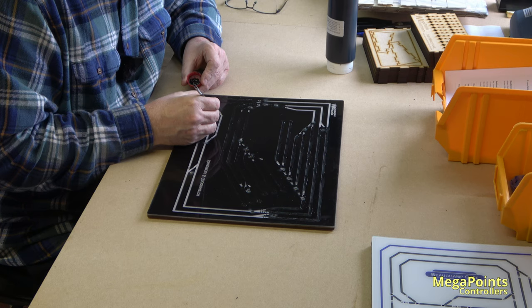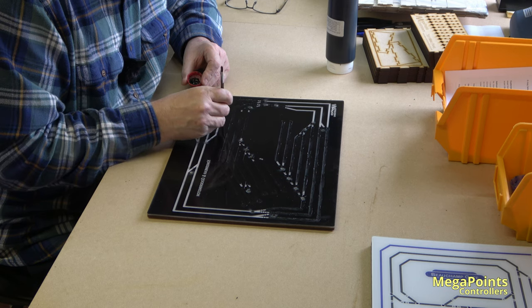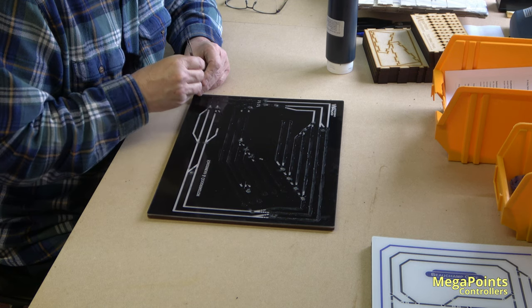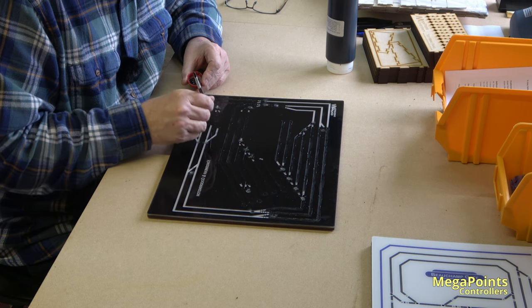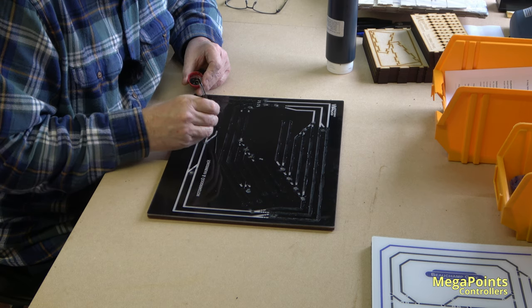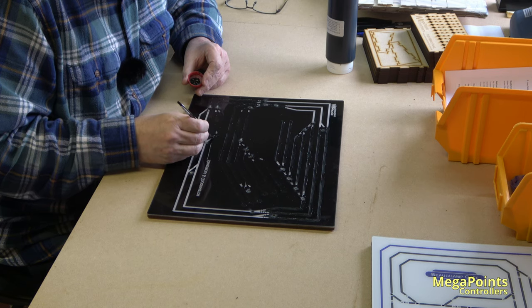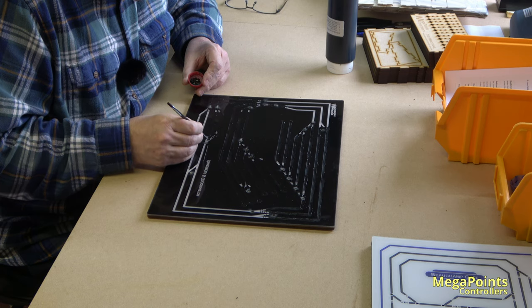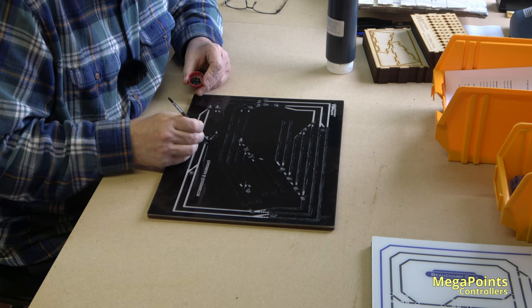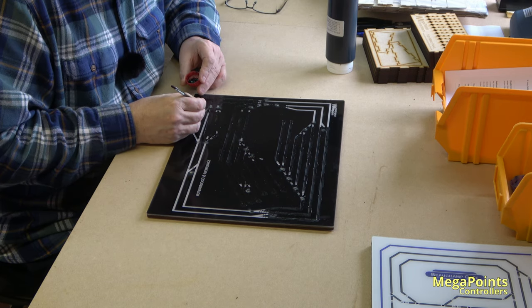And we did a bit of to-ing and fro-ing with the manufacturer. They're a Chinese company. And concluded it was either the camera on the head, or, as I thought, the vision mixer. There's a video mixer in it, a switch that switches between the cameras. They're not digital, they're analog on that model. So they sent me a new top-down camera, and they sent me a video encoder as well. Well, suffice to say, it was the camera on the head, the top-down one, that was faulty. So I had to replace that.